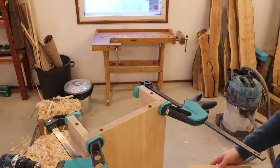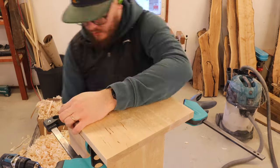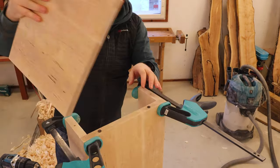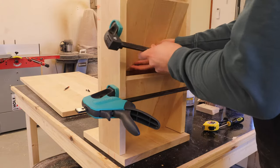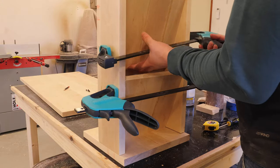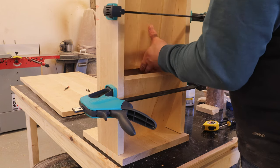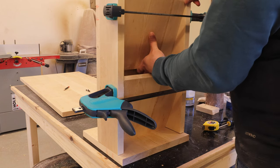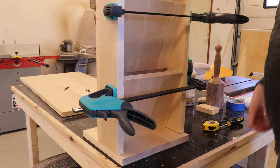On the bottom, there is also an overhang of a couple of centimeters on the other side to avoid tipping to the other direction, and I cut the bottom slightly longer to be able to do this. To attach the shelves on the vertical piece, I first attached them in place with clamps, marked down the location with a pencil, then marked the location for the dowels again with marking pins — without any mistakes on this one.